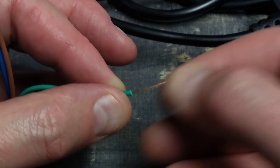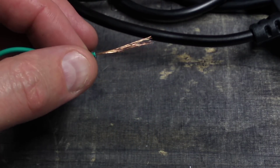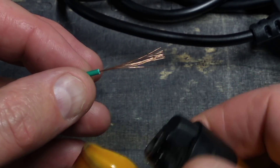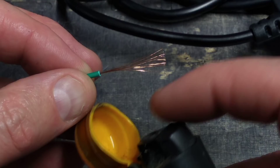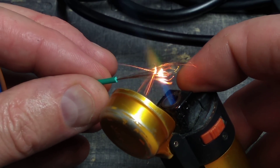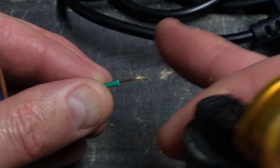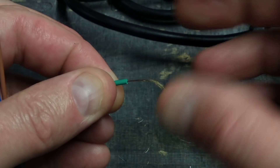The other test for this involves a cigarette lighter. I'll just ask one of my colleagues for a lighter here. If you were to hold a flame under actual copper it would stay put and just blacken and glow red. With this stuff — I'm just going to be careful here, this looks like a highly dangerous lighter — it just frizzles, goes crunchy and crisp and just frazzles up. This stuff is a disaster waiting to happen: copper-coated aluminium.